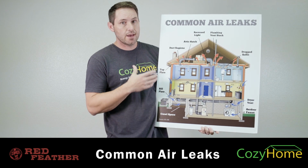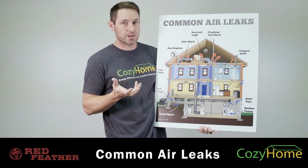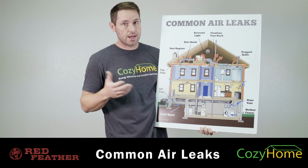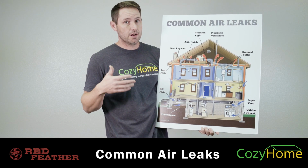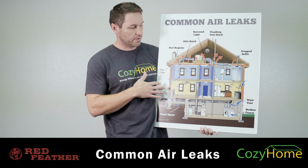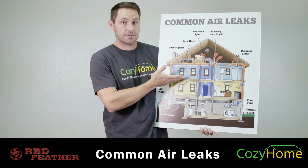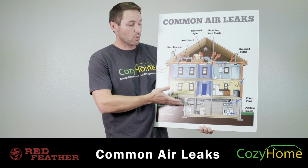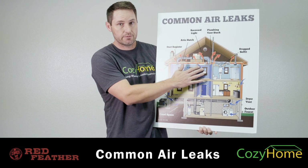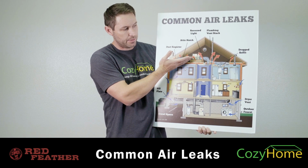The reason air leaks occur in houses is because of pressure differences. Pressure differences can be caused by a number of different things. Wind is a big one. On a windy day, your house is going to leak more air than on a still day because of the pressure that's created against the walls and your roof. Another thing that causes pressure differences is what's called stack effect. Basically, as warm air rises, it creates higher pressure towards the top of buildings and homes, and so that creates air leaks towards the top of your house.